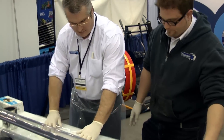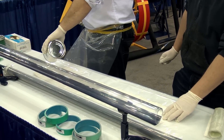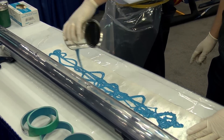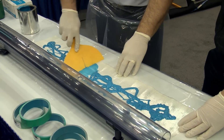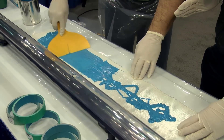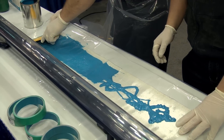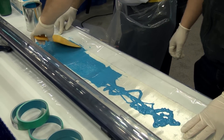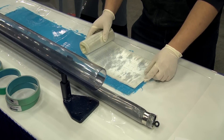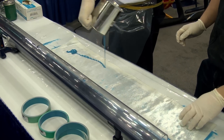You can see Stéphane is going to spread that liner down and then put the epoxy over it. For the purpose of the demo, the amount is not weighed, but usually it is. We have controlled quantities depending on diameter and length to make sure we have the perfect fiber-to-epoxy ratio. All the fiber has to be covered, otherwise you might have problems with structure. When it's wet out properly, you're going to have a completely structural liner. The overlap is going to prevent it from being too thick at some spots.